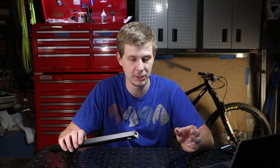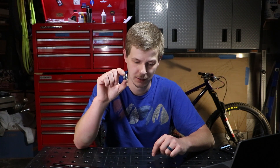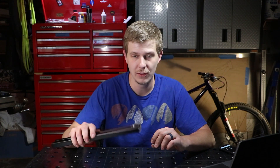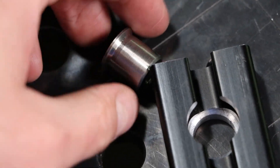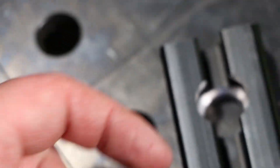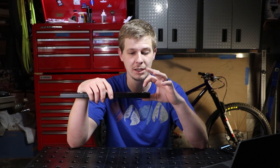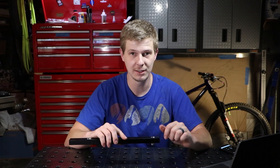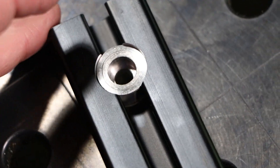This whole thing is actually very simple, but as usual the devil is in all the little details. Basically we have this pin that we fit to our table - it's the nominal 5/8 size so it fits in these holes nicely - and then we have a bore inside these rails. On these rails we have a conical interface where we have a 45 degree cut on the pin and then a matching 45 degree cut inside these bores. This allows us to locate this pin inside the rail and fasten it down at the same time, because those two angled cuts are working together and so this pin will always center itself up inside this bore.